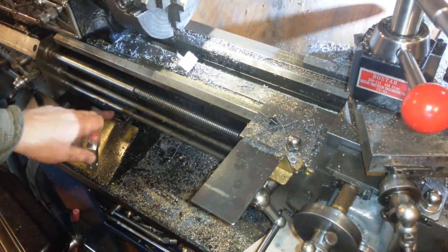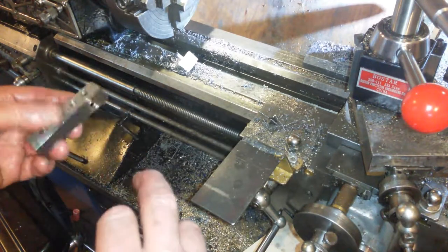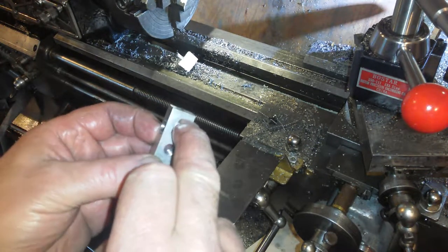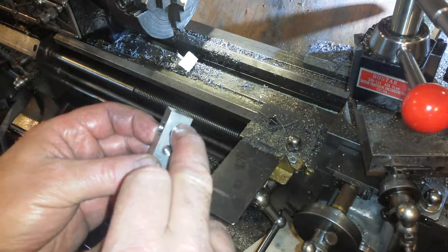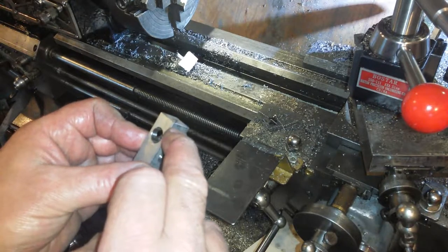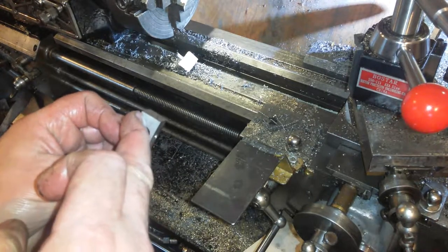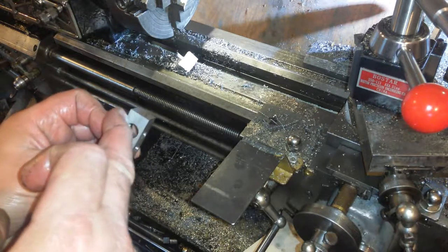So, take this clamp off, I think. Anyway, sure, there's going to be 2 holes drilled. And then counterbore for socket head cap screws, M4. So that'll be 5 mil deep, 6 mil wide, or something like that, 5.5 mil wide. And then clearance down to halfway. And then drilling tapped at the bottom half.